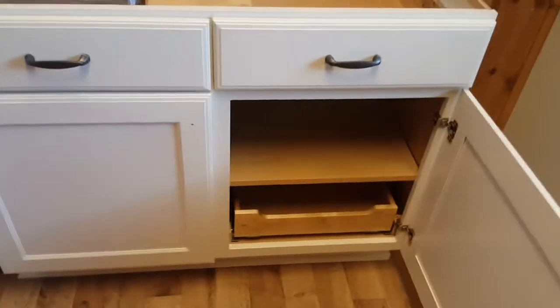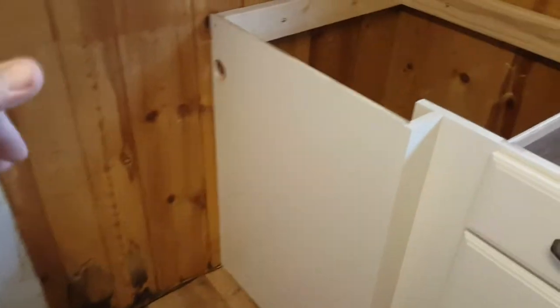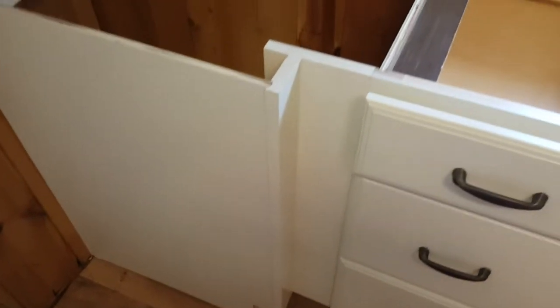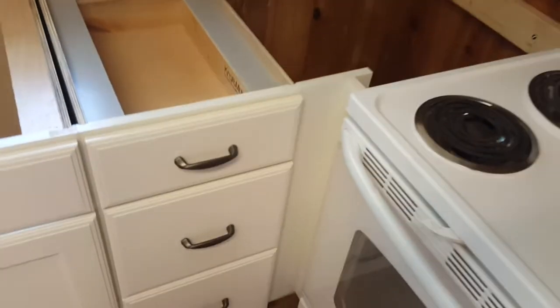In the bigger cabinet, she went ahead and did the shelf with the underlying rollout tray — same on both sides. Just so that you see the practicality: the dishwasher will sit here, and this drawer is pulled further than 27 inches — about 28 to 29 inches — so that this full overlay drawer will not hit the front of the dishwasher when it opens and closes. Same thing over here for the range, we've got the pullout of the drawer for the front of the range.